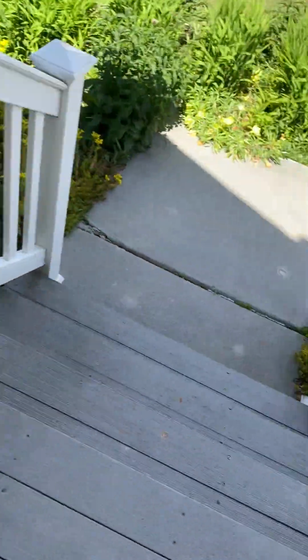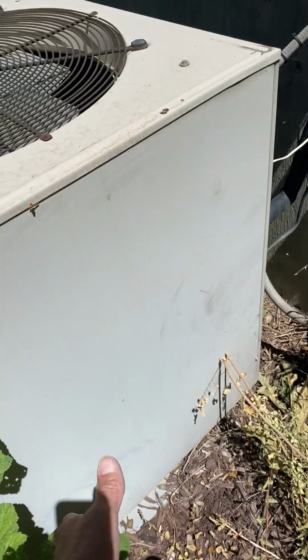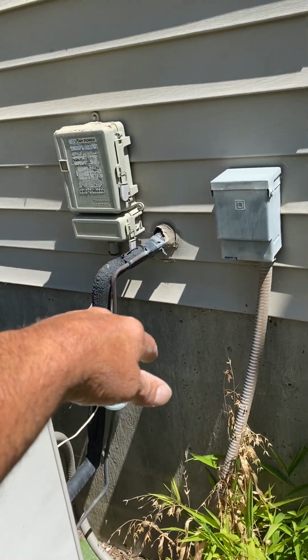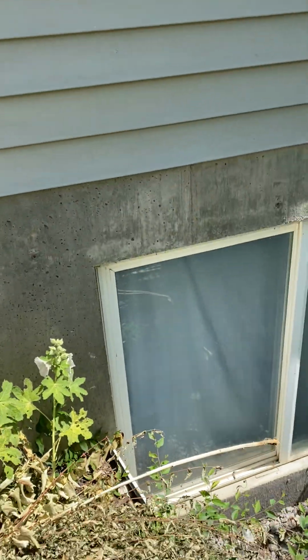So let's take a walk out to the AC. It will sit on the south side of the house. There is no fence. I'm almost done. Alright. So, here's the AC. Gonna give you a new big pad. Work it in there. Just disconnect this. You tap power, don't reconnect it. Reuse the existing disconnect, put a 30 amp breaker inside this disconnect. Okay, that's it.